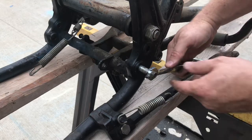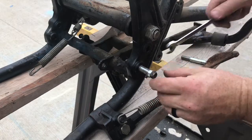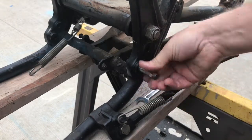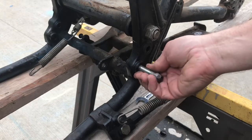Once you've done that, go on the inner nut and turn it just like you're taking out a bolt. You can see it's getting tighter and tighter — and it broke free. Now the stud will come out just like a bolt would, and I've been able to extract it without damaging the machine surface.